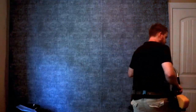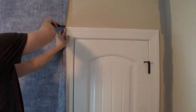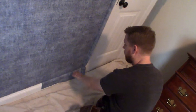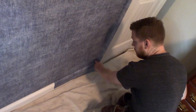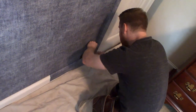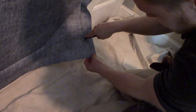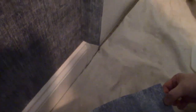To keep the paper from shredding when cutting, for a corner at the door casing you can lay the paper over onto the casing, cut right along the top, and the paper lays nicely above the door casing. Work your way down the rest of the wall. Where the baseboard meets the door casing there's always a little corner that's hard to cut and easy to tear — leaving a bare spot where you'd see the wall. Use your plastic smoother to pack it down nicely across the baseboard, trim as far as you can, then pull the wallpaper out and cut it as straight as you can.